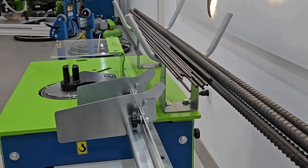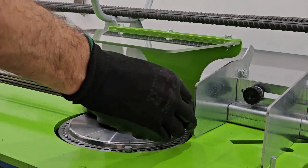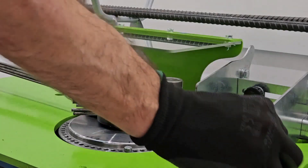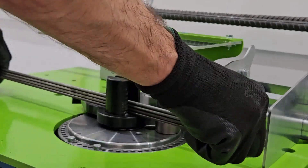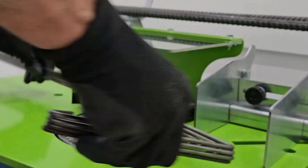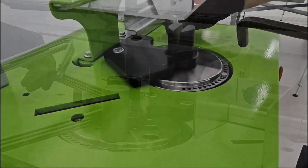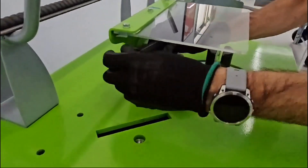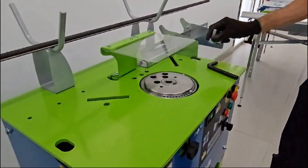Productivity is another feature. The STAR 16 Pro can bend rebar up to 16 mm, although to use the stirrup device you only need to bend up to 10 mm thick. You can bend up to four 10 mm rebars at once. And if you want to bend a larger size, simply remove the stirrup device and use a bolt as a guide for the rebar.